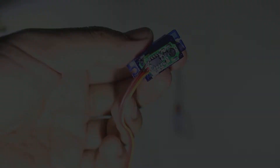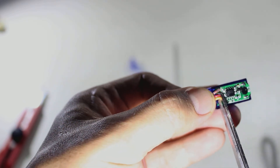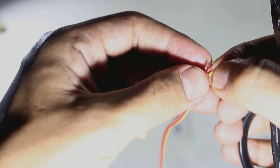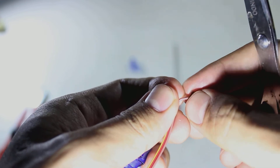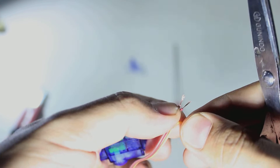After we put the gear back into position, it's time to bypass the electronics so the servo will no longer function as a servo and will only function as a DC motor. We will remove the yellow wire so it now only has two wires. We will bypass the electronics by soldering the two wires directly to the DC motor.